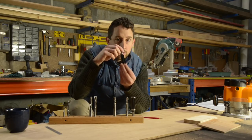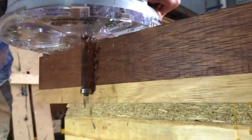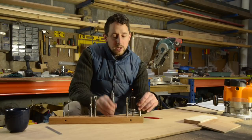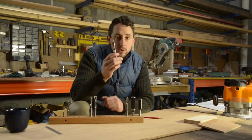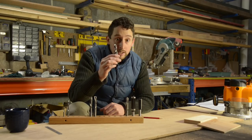When you're using a straight bit, especially with really hard timber and you're trying to cut out a lot of material, you can get what most people call chatter — basically the motion caused by each blade thumping into the wood one after the other. Because you have constant blade contact with spiral bits, you're actually getting a slicing motion rather than that thumping motion, and you dramatically reduce that chatter, which gives you a much smoother cut and means the router motor is working way less hard.